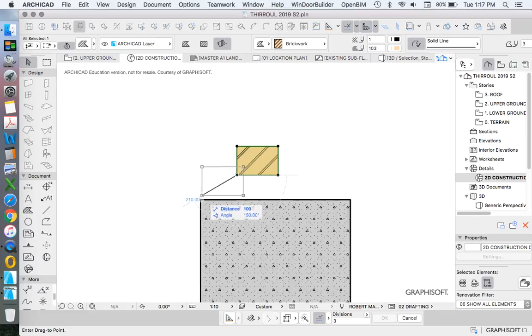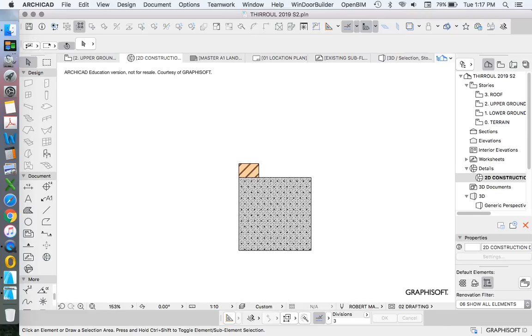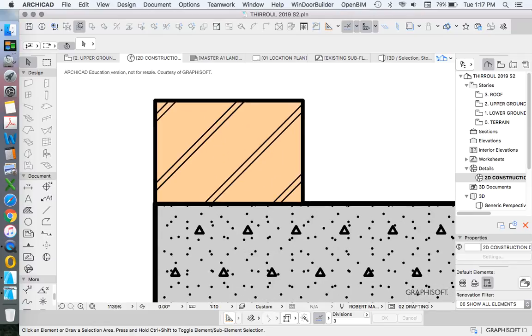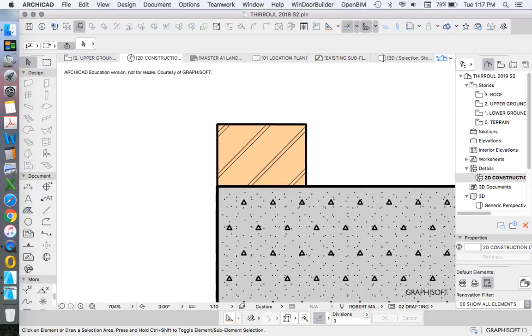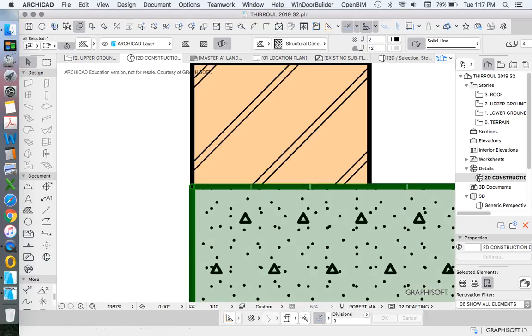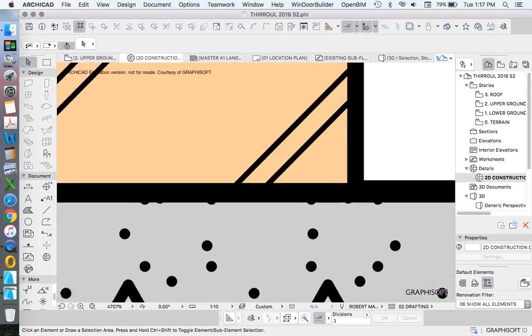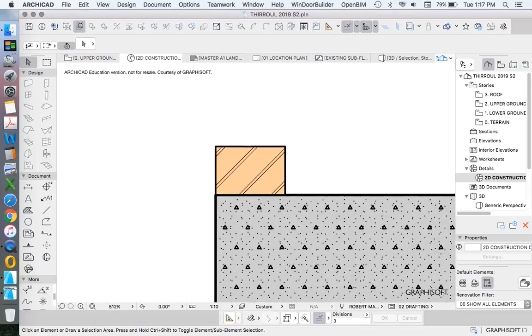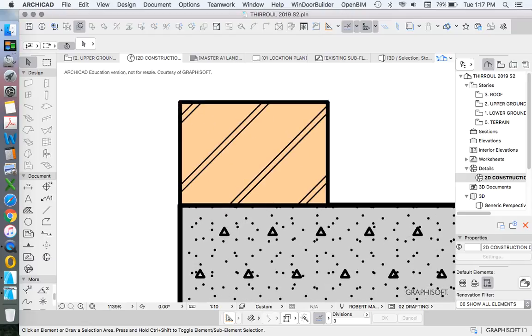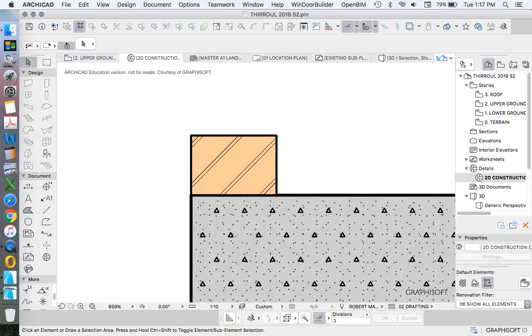All right, where am I going to place this one? I'm going to place this one aligned with the outside face of the concrete. We're going to call the outside face the left side face at the moment. And when I place it face to face, the thickness of the concrete is thicker than the outside line of the brick. And so we see that it's sort of hidden a bit. And this is a reality of drafting, that we don't actually necessarily want our drawings to be real. Sometimes we need to leave gaps between them, particularly when we're trying to show things like flashing.